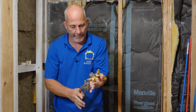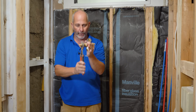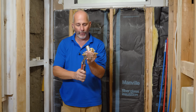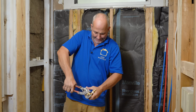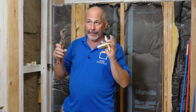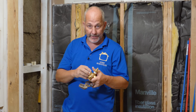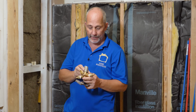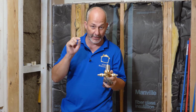Okay? Make sure all of these are nice and tight. And of course, once we get this installed, we're going to turn the water on and do what we call a pressure test. Make sure that nothing's leaking. And I might want to recommend, if you've not done a lot of plumbing before, do your installation, do your pressure test, okay? Leave the water on overnight and check in the morning to see if it's got a drip.